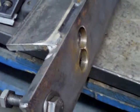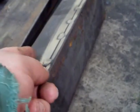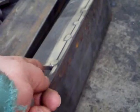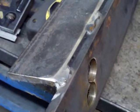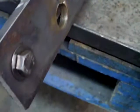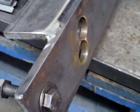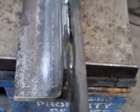I could make this out of one piece — if you hired somebody, they'd have to plasma cut it and then bend it, and they'd have problems down at this end. This smaller section doesn't need three-eighths of an inch, it's only a quarter inch. I probably don't need three-eighths on the other part either, but I'm Mr. Overkill, so it costs me a little extra time and effort to make three parts and pop all the holes in it. One of these days I'll do it right — meantime, this works.